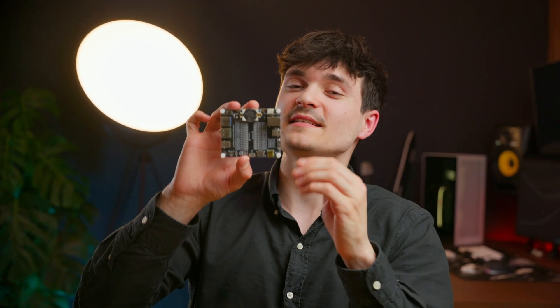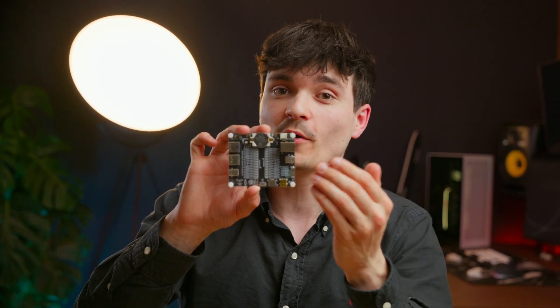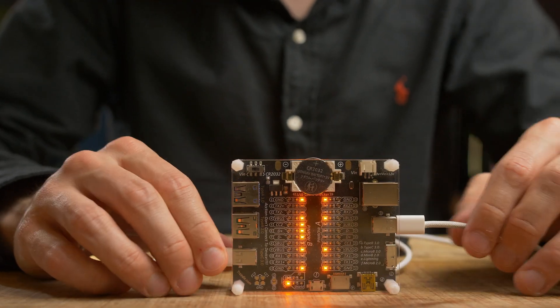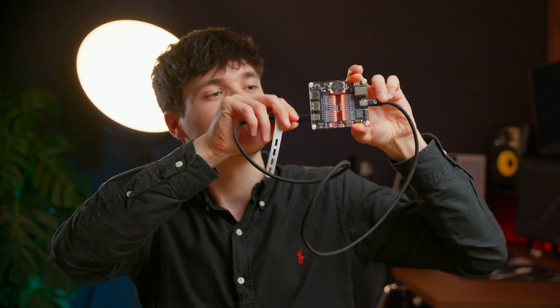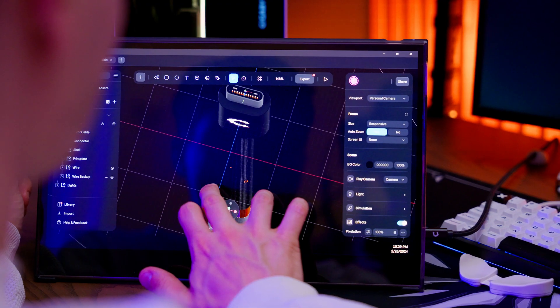Let's show you a quick test. I have this little testing device, and the lights that turn on indicate which wires are connected inside a cable. So let's take the new USB 2.0 cable that came with the iPhone 15 Pro and connect it. Now let's try the Creator Cable. As you can see, the Creator Cable uses all the connection points of the USB-C connector, and you can turn it around as well. For the specs: the Creator Cable charges up to 100 watts, can transfer data up to 5 gigabytes per second — more than 80 times faster than USB 2.0 — and as a bonus you can connect external monitors up to 8K at 60 frames. A one-hour ProRes video takes about half an hour to transfer with a standard cable, while it takes just 20 seconds with the Creator Cable.